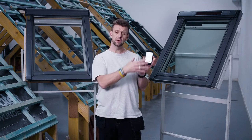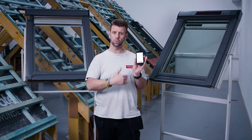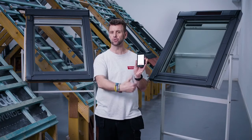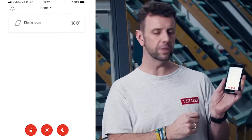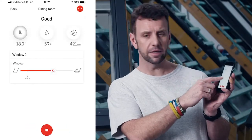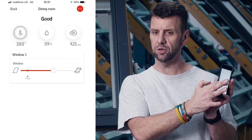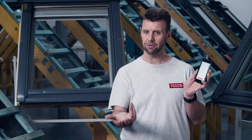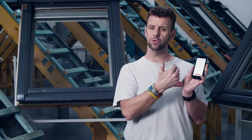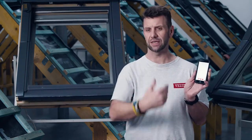You could operate the windows using the app by itself, but you'd only be getting half of the benefit of Active. You want the sensors to operate on your behalf, but you do have the ability to manually operate them if you wish. To manually operate, go into the particular room, highlight the product, and slide to operate it — releasing the button determines how far the windows open. Bear in mind the system is inherently set up to be operated via sensors, so if you manually override them, the sensors won't kick back in until the following day — basically just after midnight.